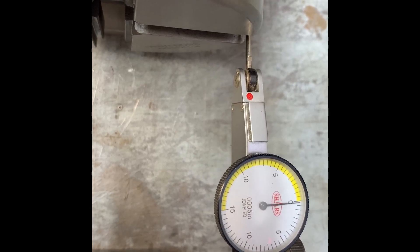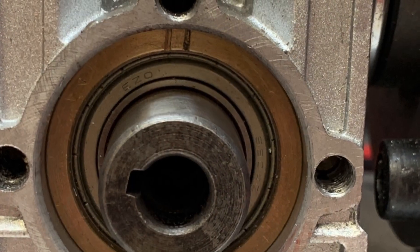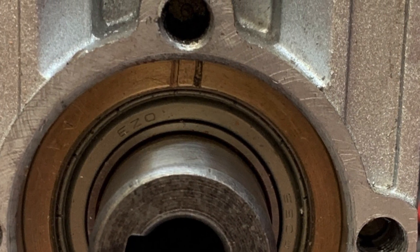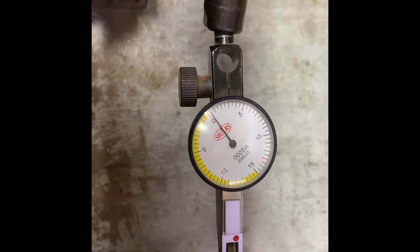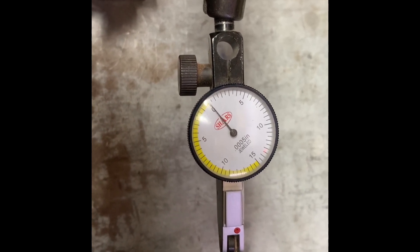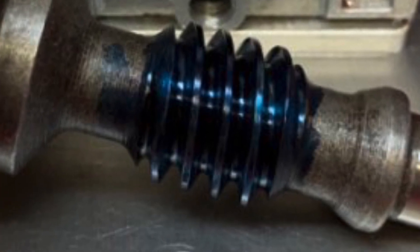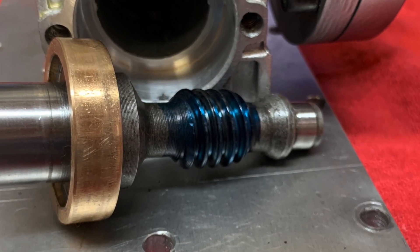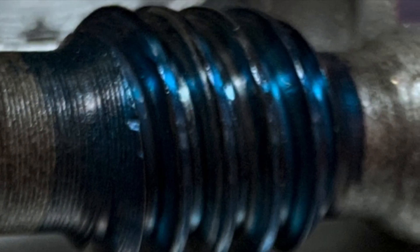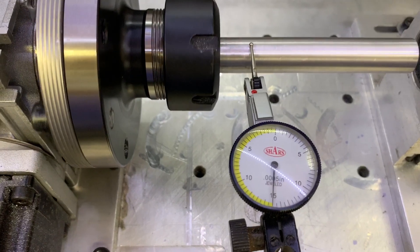So you start off with, in my case, 19 or 24 thousandths. I installed the bushings and rotated them — on mine, eventually about 90 degrees — and I ended up having to move mine all the way to the full extreme to get them tight enough. Unfortunately when I went to rotate the worm 20-odd turns, I found a tight spot, which meant it was rubbing on the worm gear. So I cleaned it, put some Dykem on it, ran it for a while, looked at the wear pattern, and realized it was touching on the OD of the worm and on the major pitch diameter of the worm gear. So I just stoned a few thousandths off the OD.